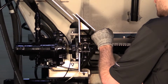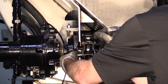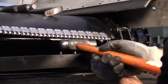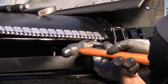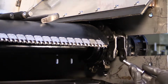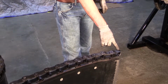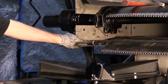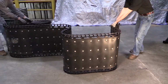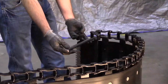Remove the conveyor chain connecting pins. This procedure will use the old conveyor to pull in the new conveyor. To match the chain links between the old conveyor and the new conveyor, the new conveyor must be unrolled, then re-rolled from the opposite end. Position the new conveyor on one side, carefully unroll the new conveyor, and re-roll the conveyor beginning from the opposite end.